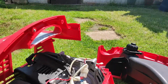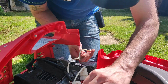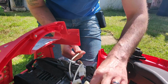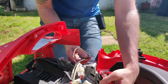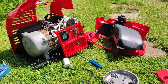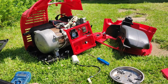Let's bring you in a little closer and I'll explain what I mean. So that switch goes to these two wires, right? And one of those, this through here, ends up as the positive. This one here is the positive for this, so there must be continuity for me to get energy through there, right? So if we go back to our switch, bring it back a little bit, I would say there should be continuity at this switch for me to have power, and there is not.